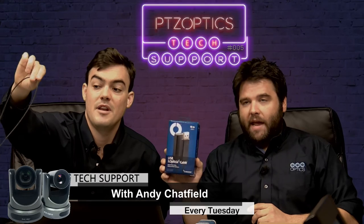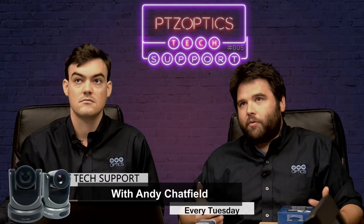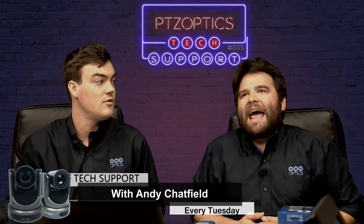Look how thin this cable is — that is fiber optic. It's very, very brittle. The Corning cable's pull strength is about 35 pounds. I've had a lot of integrators try to pull them through thin conduit; the head gets caught and they end up breaking the cable. I will say that Corning is fantastic with their tech support. If you have one that breaks, they will most likely replace it for you regardless of how it broke — you just have to get in touch with them. I think they're also working on making it more robust.